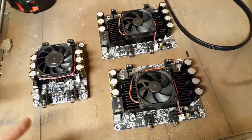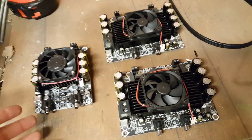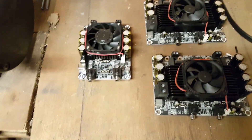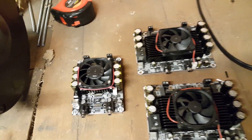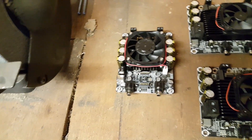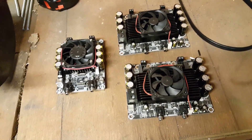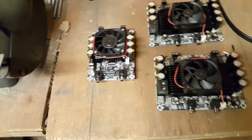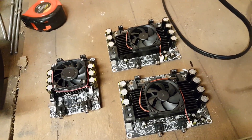When they say 500 watts per channel, they don't specify how much distortion is added to the signal. If you look closely, it usually says it outputs a lot less under a specific distortion level. This one outputs 250 watts under 0.1 percent distortion, which is actually quite a lot in high-end audio — it's pretty poor quality. But I'm not rich, so I'm just going to build one myself that will work.